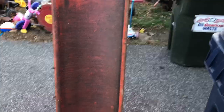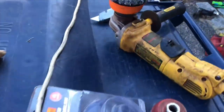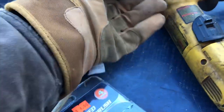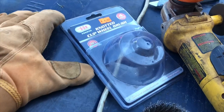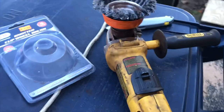I decided to repaint the snowplow for the 8163B because this thing is pretty rusty and pitted. We're using a grinder with a wire brush cup on it and it strips down the paint pretty good. If you've never used one of these, they're really awesome. This one was on there for about a year and finally wore down, but look at the difference. I got this at a tractor show or flea market for four bucks, but that's what I like using — so we'll strip down this front and see what we got.